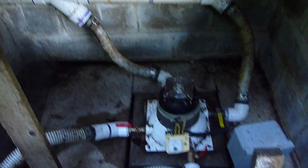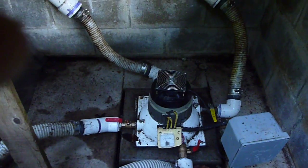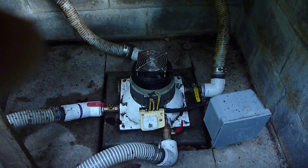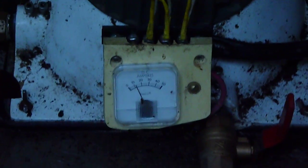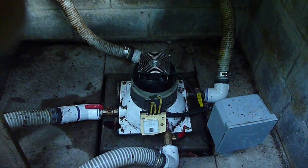It's a Harris turbine, four nozzles as you can see. This is the only nozzle that's actually currently open and working right now because of the low flow. There's the electrical connection that passes the wires underground to the powerhouse. There's our amp meter showing how much power we're getting. There's a fan on top of the turbine to cool it off at higher production — right now we don't really need it.